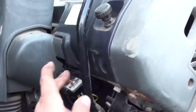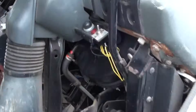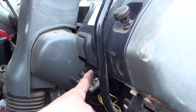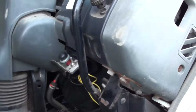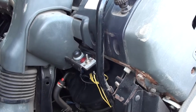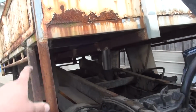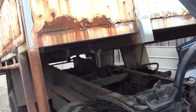What everyone's been doing, because it takes so long for an empty tray to come down, is flicking the lower it down disconnect button up onto the on position and leaving it there. There's a 24 volt 20 watt solenoid sitting on the side of the pump running continuously to hold open a valve, so when you get down to the last level it's really slow. After it hasn't been used for a while, it's probably even worse than this.